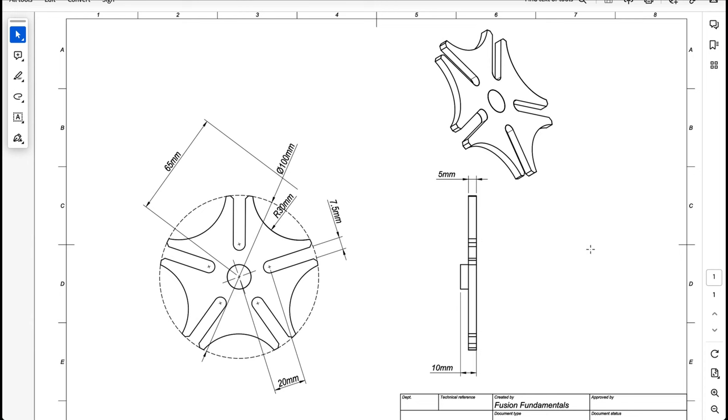We're going to start off by drawing the index plate. You can see the outer diameter is 100 millimeters and this inner diameter is 15 millimeters. It is not marked there. And then we'll just do these slots that have a 7.5 millimeter diameter. So that radius will also be 7.5 over 2. Then we've got our 30 millimeter arc in there.